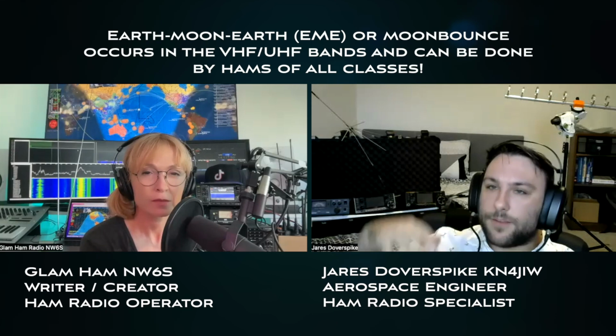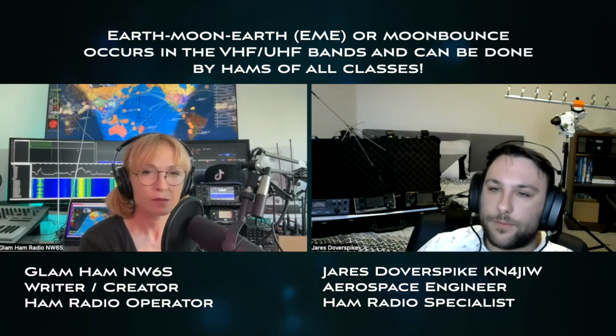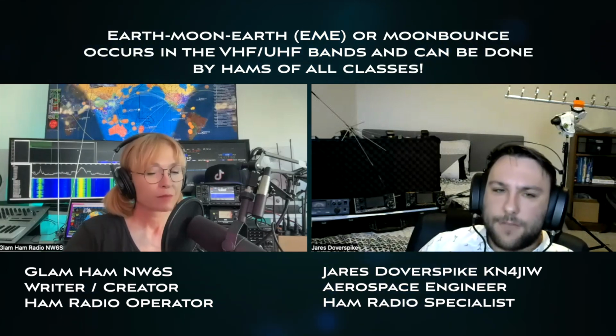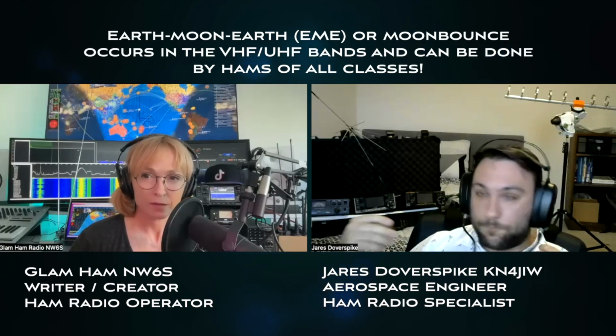No. Normally you're wanting to use a little bit higher frequency just because of the properties of you're bouncing it off of effectively ground. So because of that, you're wanting to use more into the microwave band. But if I remember correctly, I have heard of people in those bands doing EME. So it's not impossible, but you might be limited a little bit more on power, because there are charts out there that give you graphs of the attenuation depending on the frequencies that you're transmitting at.